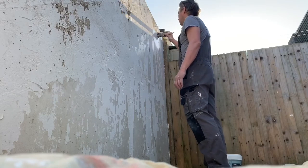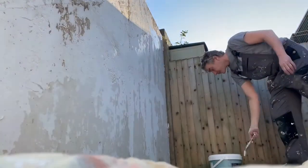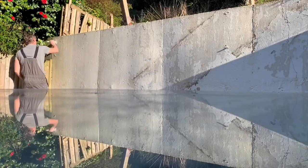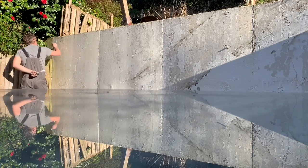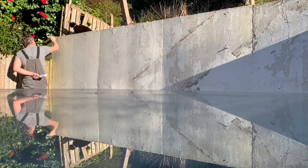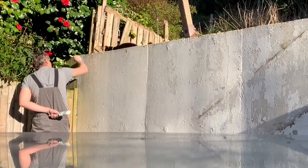Put a little extra paint in there — we're not filling the hole but you want to try and cover it up a bit. Paint is not filler. I'm going to start off doing the side edges. I've got dust sheets down to catch any wayward paint. They need to stay in place till later. If I do the bottom edge now I'll have to pull the dust sheet away from the edge and I couldn't put it back against the wet paint.